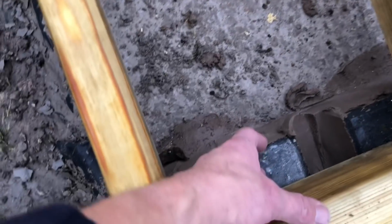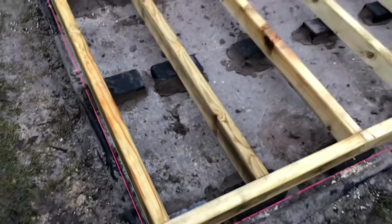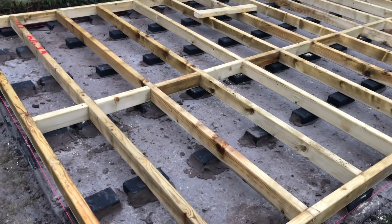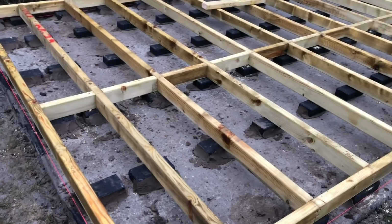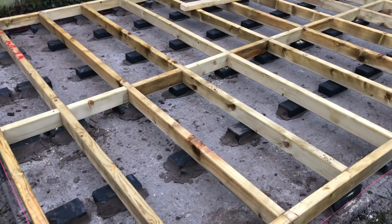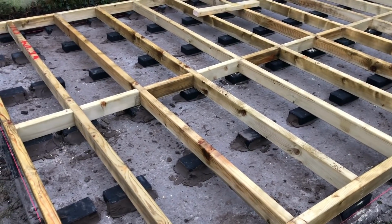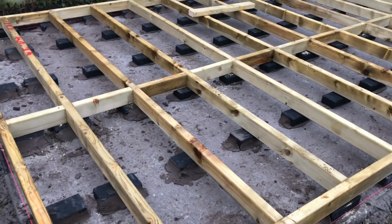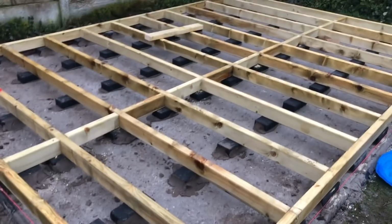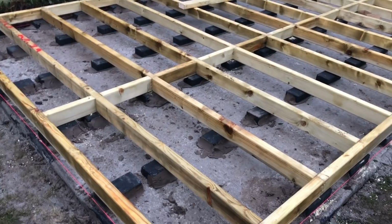We're going to put insulation, it's going to hit that there, we're going to have an air gap underneath, the air gap here with the insulation, and we're going to stick marine ply over the top just on the bottom, only because it could get rained on. I mean, we will cover it up, but it could get left for a few weeks, so that's why we're only using marine ply. Now if you're doing it in the summer, you could use something different, but as you can see, this is the stage we're at, so when you see it next, it will be completely different.